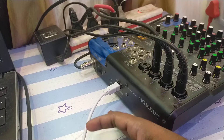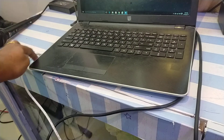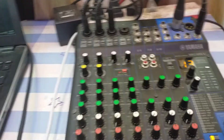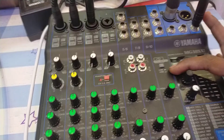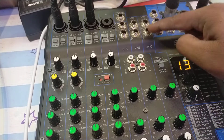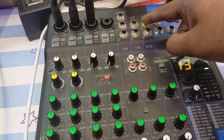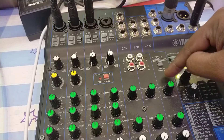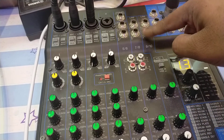I've connected the printer cable — one end into the audio mixing console and the other end back to my laptop's USB port. That completes the cable connection. On the audio mixing console, there is a dedicated USB line-in on channels 9 and 10. You can use this channel as a regular line channel to connect mics or accompaniments, but if you want to use it as a USB channel, you need to press a specific button.